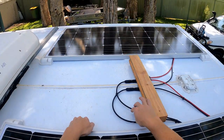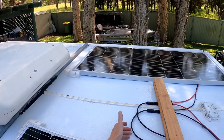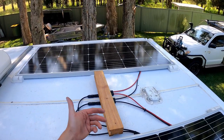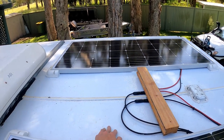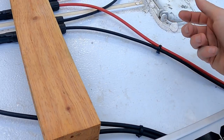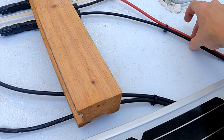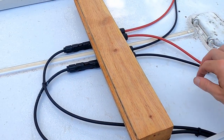I was a little concerned that these wires would act as a dam and stop water and leaves from the roof running off. So what I've done is put cable ties around them, turned so the head of the cable tie is sitting on the deck — which holds the cables up — and then just put a blob of silicone around it.